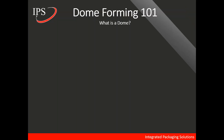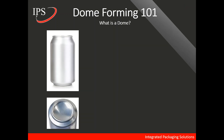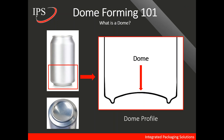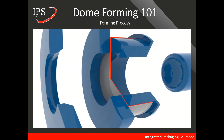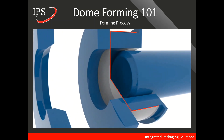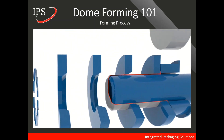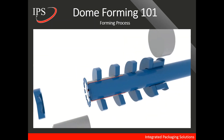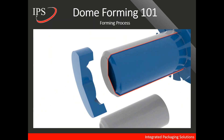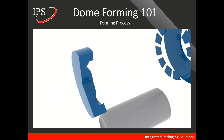Let's start from the beginning and build our knowledge base. So what is a dome? The bottom of the can in the 2D profile looks like this — and this is the dome of the can. The dome is formed inside of the body maker when the cup drops in and the punch forces it through a redraw die and a series of ironing dies, changing the can to its final diameter and thinning the metal to its final height, before it hits the domer and strips off of the punch and exits the body maker.